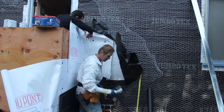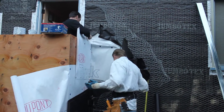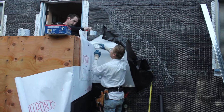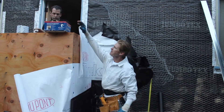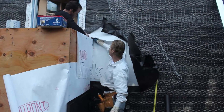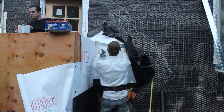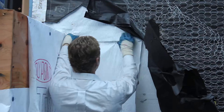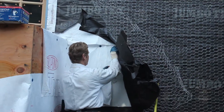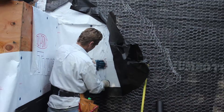Tim is going to cut that joint out right there and back to the tape. Tim, you want to grab me that tape, please? This flashing here is the cap. The cap gets the DuPont and it comes underneath the wall here. And we somewhat do like a flex wrap right here. And then these joints here — now that we're underneath it, we're going to tape this vertical joint here and we're going to tape the horizontal joint, just like so.